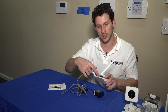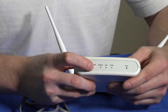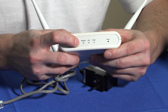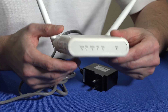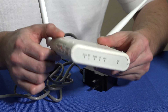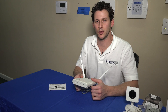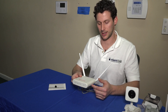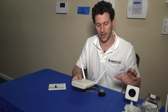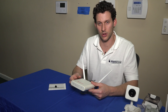You can use these ports to plug cameras in, or you can wirelessly connect to them by using the WPS button on the front of the unit. You would press and hold this button for three full seconds, and it would put the WAP into enrollment mode. When you're in enrollment mode, you have to get over to the camera within the first minute and press and release the WPS button on that camera — we showed you in the other videos where the WPS button is located. You just get this thing in enrollment mode, then go over to the camera and press that WPS button. Be patient and give it a few minutes, as sometimes it takes a little bit of time to enroll in the network.